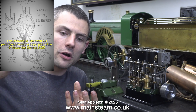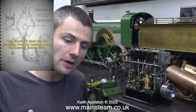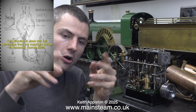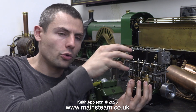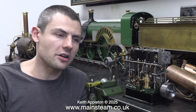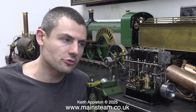It wouldn't be efficient if the water just entered through a hole and fell to the bottom. The goal is to cool as much of the steam as possible with as little water as possible, so we want something that sprays an atomized mist of water all around in there, so that the steam going from the top down has to hit water on the way. When the steam is cooled sufficiently by this spray it collapses in volume over 1600 times, and because it's in a closed space where no air can enter to fill this void, a tremendous vacuum is created.